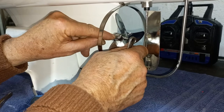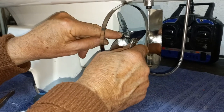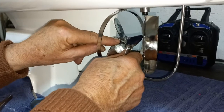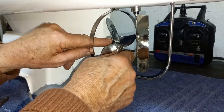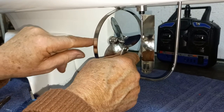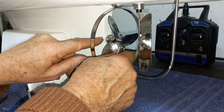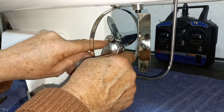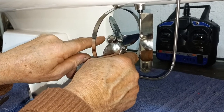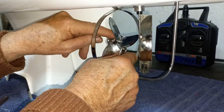Otherwise you waste battery and create heat — a lot of heat on the shaft. Although this end is in the water, convection is very slow in stainless steel, so it may cool, but it will not cool the whole shaft quickly enough to prevent it from burning the bushes. So it's very important to ream the bushes if you find that your shaft doesn't slide too easily. The seal is contained in this half, so ream the shaft if need be, and make certain that you have some play on these washers.